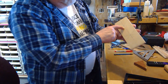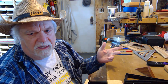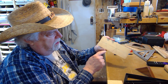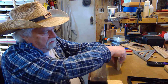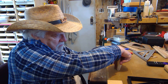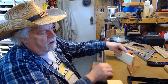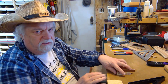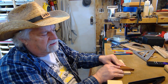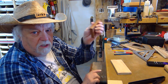Now I have a center line and I used nothing more than a scrap piece of wood to do it. The key is that as long as your board is square — if your ends aren't square, you have to use a reference line that is square to the board. In other words, if the end wasn't square, I would just set this up and draw a line that I know is square to the two sides, and reference off of that any time I line up to make my marks. If you're in the middle of a board and can't use the end, mark a perpendicular line and that gives you your two corner points to reference with the corner of your triangle — you can still do it even in the middle of a board.